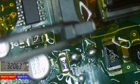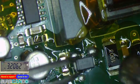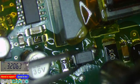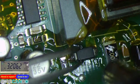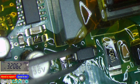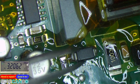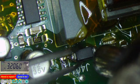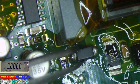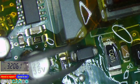They use solder paste. They put it on those dots, and they put the components on top. Put it in the oven, and everything just melts into its location. Yeah, they do. This robot just drops them all in under this thermal solder paste. So there isn't really a human sitting there manually doing each one, no.